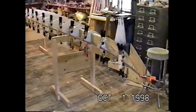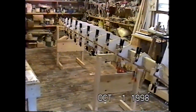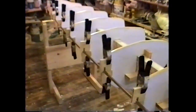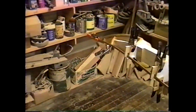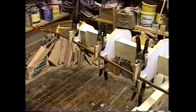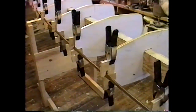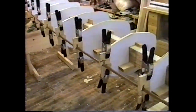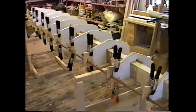I've laid out the first shear strip — that defines where the top and bottom of the kayak will come together later. As you can see, it takes a lot of spring clamps. But that's the first strip. I coated the edges of all the forms with shellac because rather than using staples, which any sane person would use to put the strips on, I'm going to try to hot-glue-gun them on. That way no staple holes will show. We'll see later if that's a good idea or not.